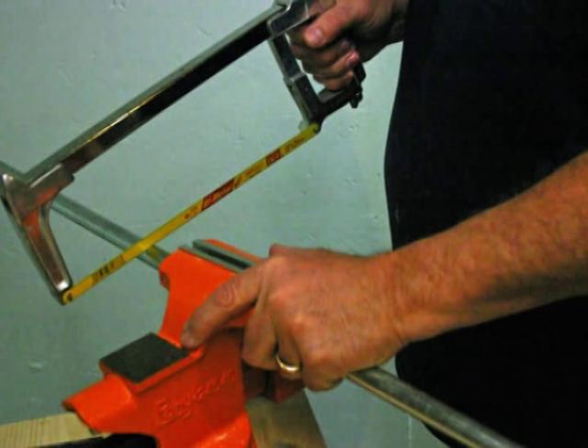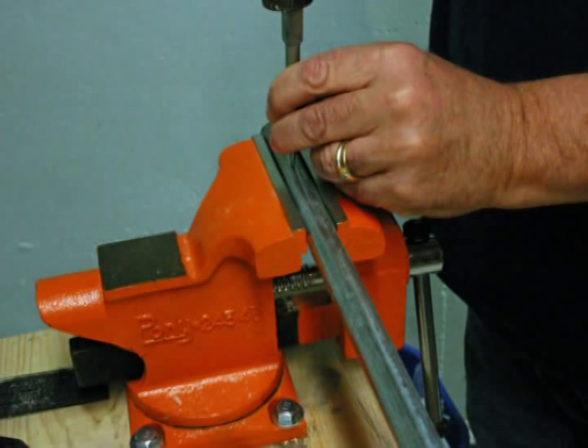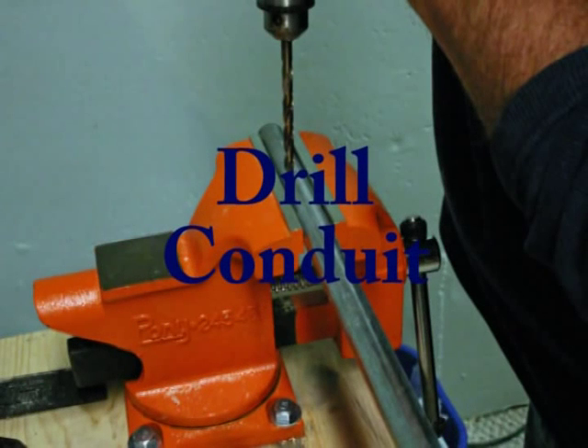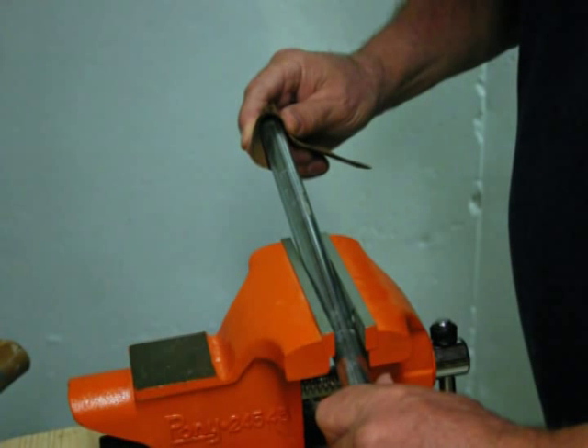Note that the 90-degree elbow will provide an additional 7 inches to the horizontal length. Here's the hard part if you don't have a vise: clamp the horizontal piece of the conduit tightly using a vise or some other clamping mechanism. Using a hammer and a set punch or heavy nail, make a small dent approximately 2 inches from one end of the conduit. Then drill a quarter-inch hole all the way through both sides of the conduit, keeping both holes centered between the sides of the pipe as shown.